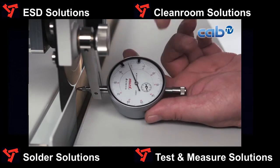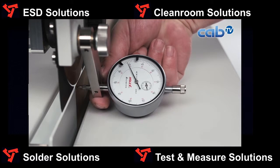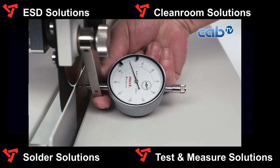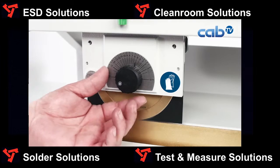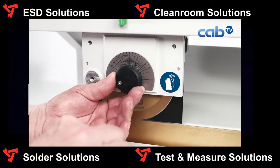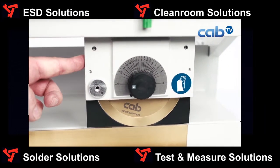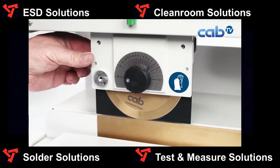We finally achieved the displacement we intended to have. Almost exactly 0.3 millimeters. What we are doing next is adjusting the lower stop. The upper blade is in its lowest position, about 0.2 millimeters below the top of the lower blade. As we move the slider, we see the blades do not touch each other.